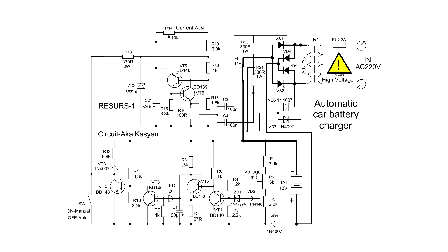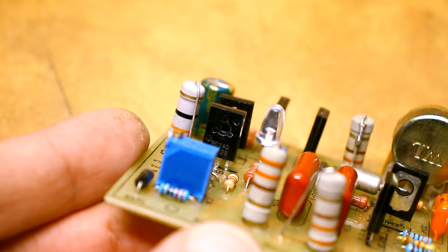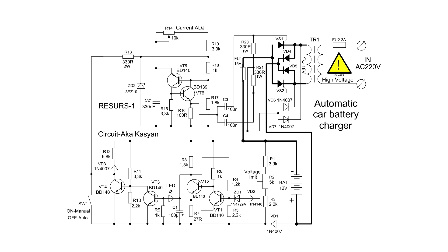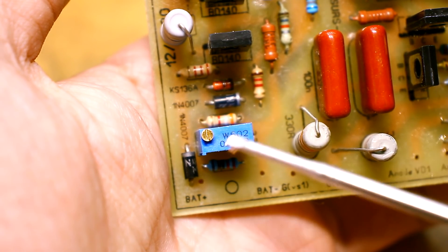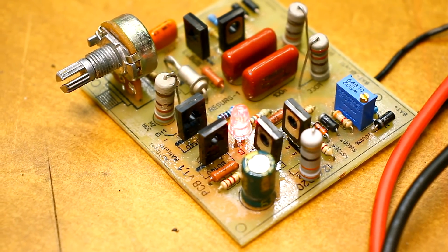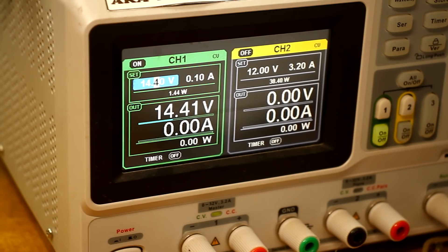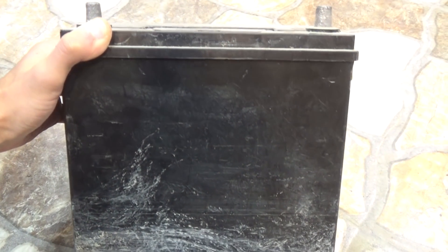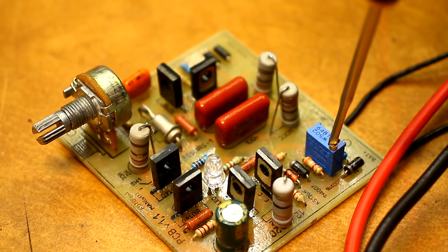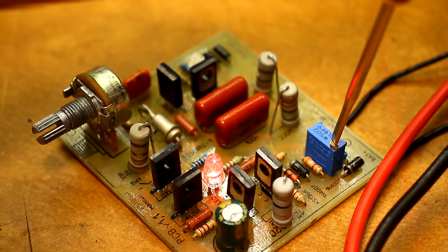About the components: I used the more reliable medium-powered transistors BD139 and BD140. Maybe it didn't make much sense, but they are better than the original circuit. It should be noted that before soldering the trimmer, it must be set to the middle position. After assembly, the operation of the automation system can be checked without connecting the power unit. To do this, instead of a battery, connect the laboratory power supply and set it to 14.4V — that is, the end-of-charge voltage. This may be a different value depending on the type of your battery. Then slowly rotate the trimmer until the LED lights up. This completes the setup.